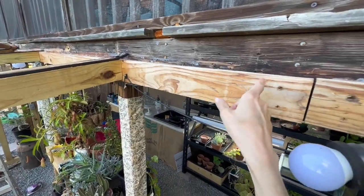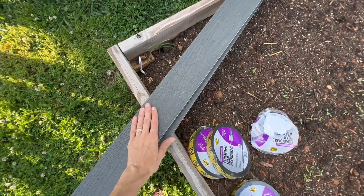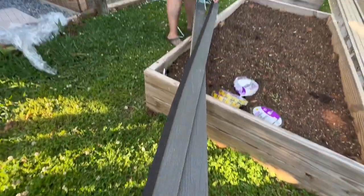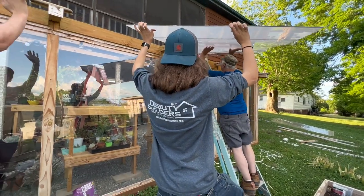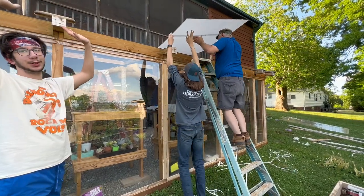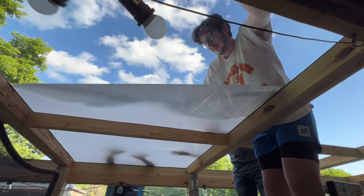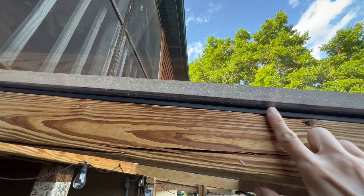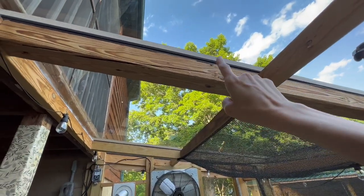We're actually going to put some caulk right here where it meets the house. So after we get the glass on, this will be laying on top of it, and then we'll put the Trex on top of that. We'll actually turn it the other way because it's got some grooves so water can run down. There are seeds in here but if you need to step in there it's fine — I can plant more. So we've put the rubber, then the glass, then the foam, then the Trex, which we're screwing down now. The foam and the rubber are sandwiching the glass, holding it in.